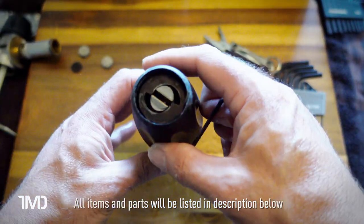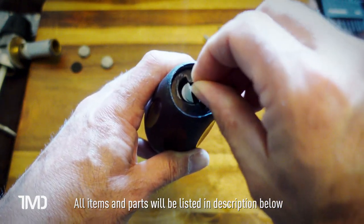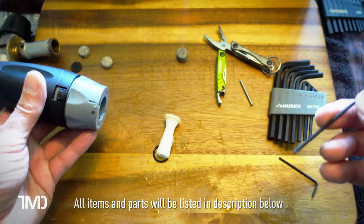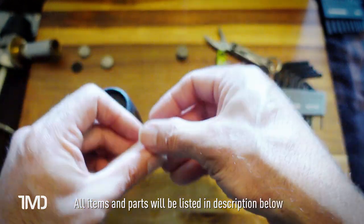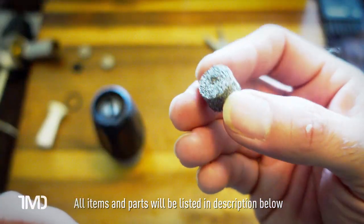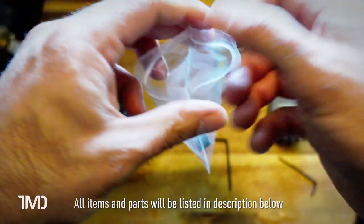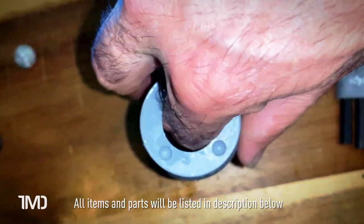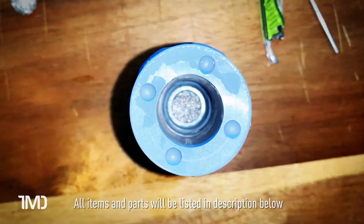With the nozzle as a separate unit, open the orifice all the way and stick the allen key straight down the center until it can't go deeper, then give it a few taps on the table to pop the filter out. There's also an O-ring that comes out — set that aside. We've got the old filter removed. Taking the brand new MTM filter, place the nozzle vertical on the table, drop the filter in, and use your finger to position it correctly inside the filter recess until it sits snug.